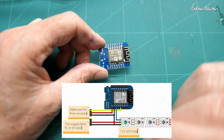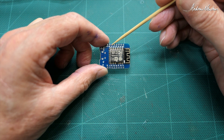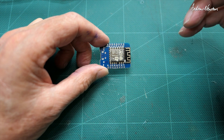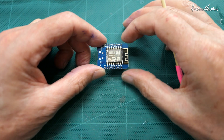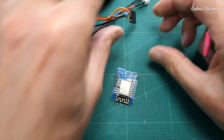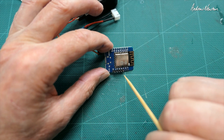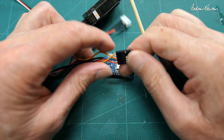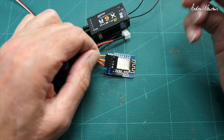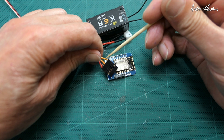With a 12-volt strip you do need to power the LEDs separately, but the grounds need to be common. To put it into WiFi mode so you can set it up, you can short the D7 pin to ground momentarily, or you can switch from zero to a hundred quickly five times within five seconds using your switch, and that will put it into WiFi mode. Here's the one I've soldered up — I've soldered the pins on so I can plug in and out. That's a five-pin pin set, not using D3. I have a five-pin DuPont connector — you can just use servo connectors if you want. So we've got 5V, ground, LED signal out, and PWM signal in.